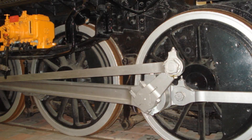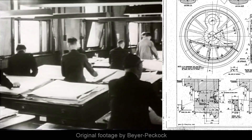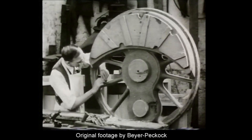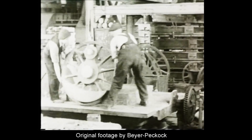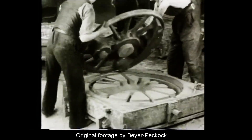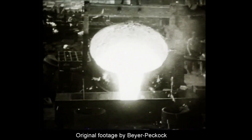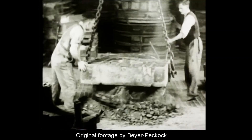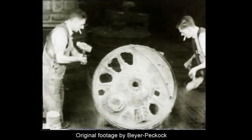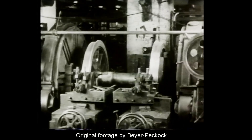The production of wheels for a steam locomotive involves several work-intensive steps. It starts with classical construction, including all calculations and drawings. Based on that, a wooden model is built and shaped for the production of sand forms. The cast is always a special moment, and the most important tools for shaping the wheels are heavy hammers. The turning machine of remarkable size delivers the finalization.